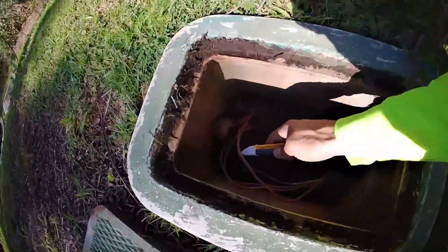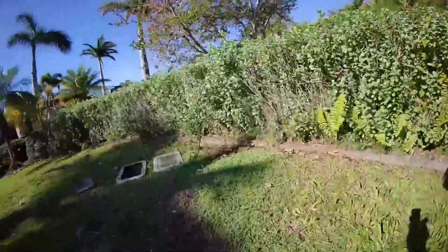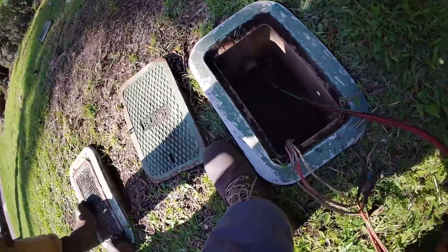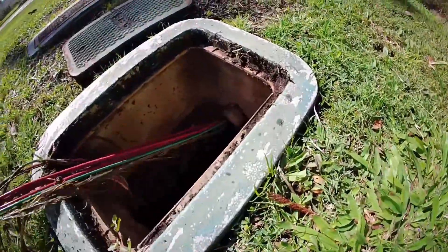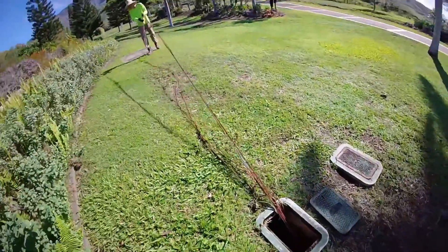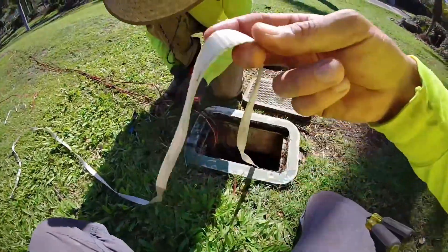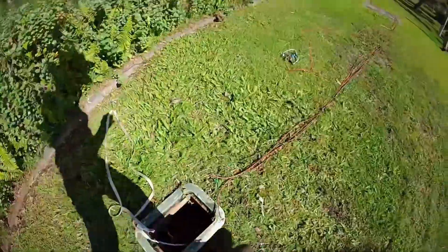Just for fun, just make sure that there isn't something really bizarre going on — like it's the wrong feeder or something. Okay Jaden, here we go. This area is spliced, so we'll just cut it here. We'll tie this on and we'll continue to pull it all the way through until we have a rope through the whole entire conduit. Moving on to the next one.